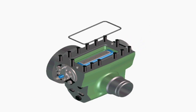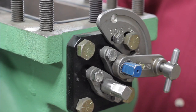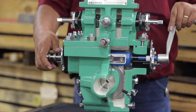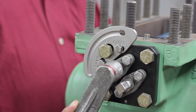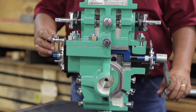The eccentric plug with Teflon seal has proven to perform exceptionally well in most applications and varying temperature requirements. The standard SureShot design features a safety locking device to prevent the operator from inadvertently opening the sealing valve when the top chamber is open to the atmosphere. SureShot's locking system requires that the technician use two hands to open the eccentric plug, preventing accidental opening. This protects against personal injury or property damage. In our industry, only the SureShot offers this peace of mind as a standard feature.